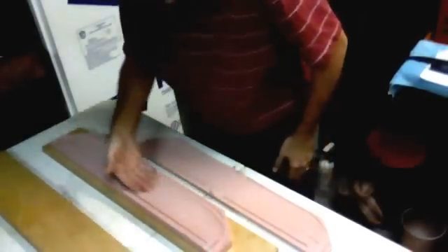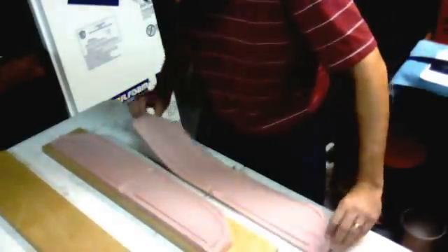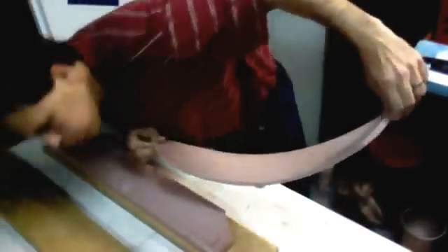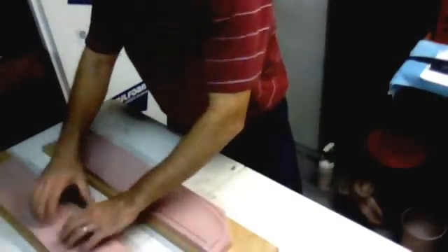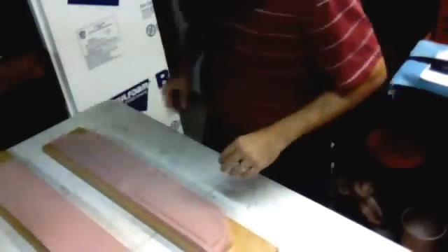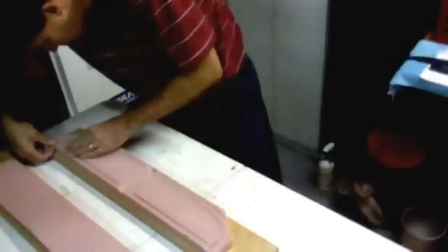You can feel there's a bit of static building up on here. That's the one interesting thing about silicone — they do get a little bit of a static buildup on it. So that's why I'm putting this mold back face down; I don't want dust to collect on it. All right, I've got this fill gate over here.